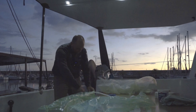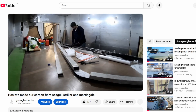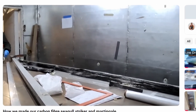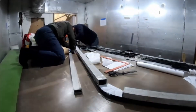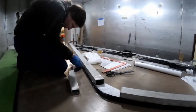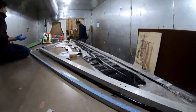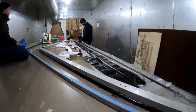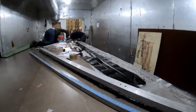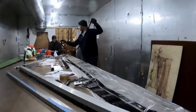I was thinking about the press thing. We did use that technique to make the carbon strap. At Martingale, we used the pressing technique where we clamped the carbon uni between two bits of aluminium box section in that funny shape. The likes of companies like ATL in Australia, they make big epoxy panels by clamping them in a big press. There's heaps and heaps of companies and products and techniques that use the pressing method as opposed to a vacuum method.